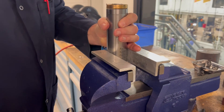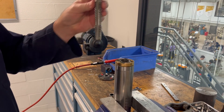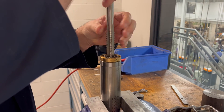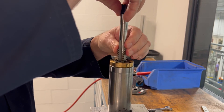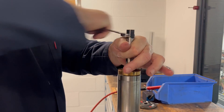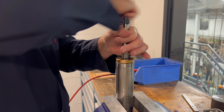I have my aluminum soft jaws here to protect the spindle, and a matching Acme tap — this is a left-hand tap. I'm just going to gently chase this down in here so I don't mar the threads or cross-thread it. I'm going to take it until it binds up a bit, then just turn the tap. I don't need a tap handle because all I'm doing is correcting and cleaning the thread. I'll back it out and give it a puff with the blowgun, then put some fresh lube in there.